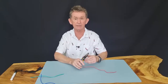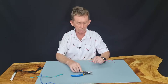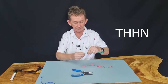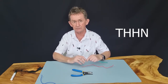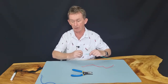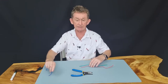Klein Tools are made in the United States of America. Now, the fully automatic wire strippers do not work with this type of wire. This wire is called THHN, where there is a sleeve on the outside — not just rubber. It has a fireproof protection sleeve outside the rubber, so automatic strippers can't pull it off. Whereas a normal flexible wire is often not THHN.